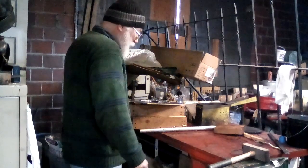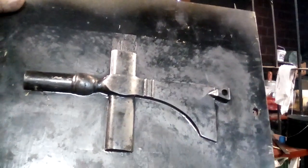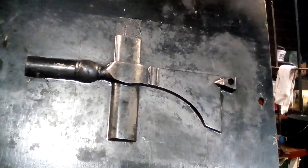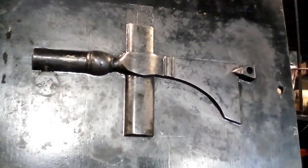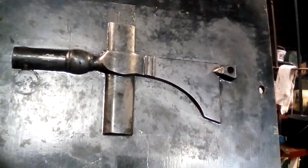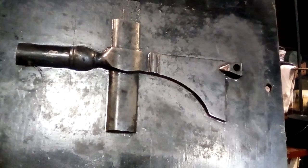This is the little corner of the one bench that I use for ramming up the molds. I have some homemade casting flasks, and I have my pattern for this particular tomahawk. That is a pipe tomahawk that has a place for the core pattern to make the eye — that's what that thing that looks like the handle in the center of the tomahawk is. The extended shaft from the bowl of the pipe is so that you can chuck it up in the lathe and do the ornamental turning on the bowl, and that's also why there's that boss on the edge side.